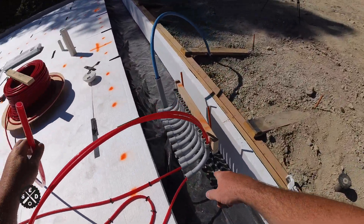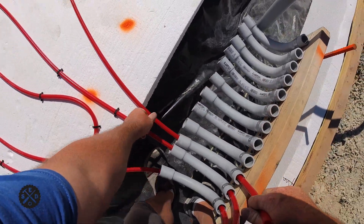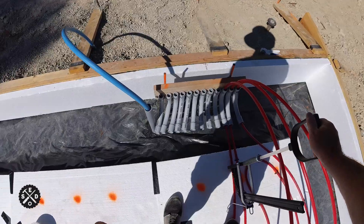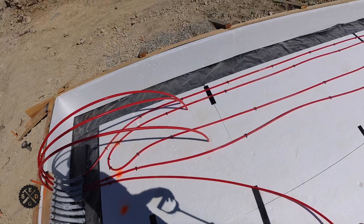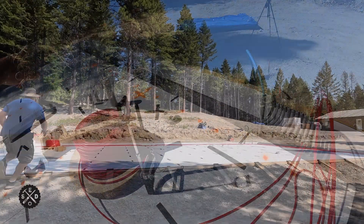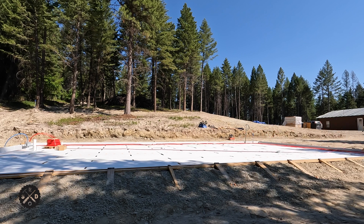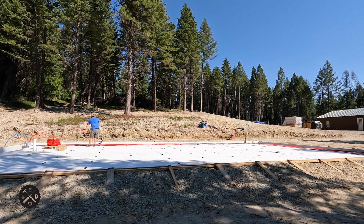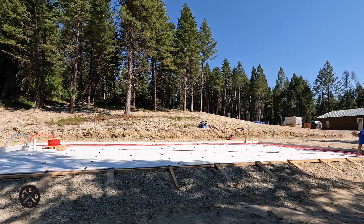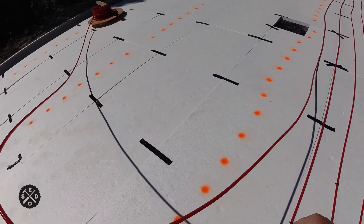For getting the next run in, I'm using one-inch 90s — one inch gives you enough room to get the half-inch PEX in with ease. You just slide it in and pull it through, then match the ends up so you know you have the same length. That run ended up being almost exactly 300 feet. I'm able to do two loops per roll doing approximately 12-inch spacing — you don't have to be exact. I experimented with setting the PEX uncoiler in the middle since I was fighting it to one side — it's a little trial and error figuring out where to set it up for a smooth process.